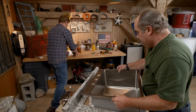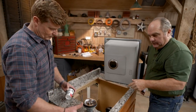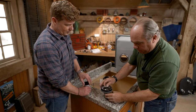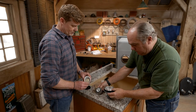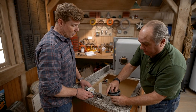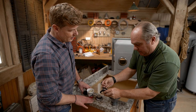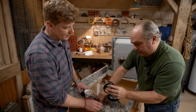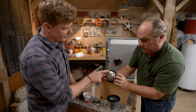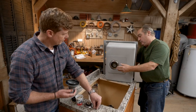Alright, so that's going to fit perfectly. We can do some of this work up here instead of under the sink. Every sink needs a basket strainer, and they keep changing it. We're not going to actually use putty — I've always used putty, but this manufacturer is pretty interesting. They have a pre-made gasket that'll act in lieu of the putty, so we're going to trust it. They call out that this will do fine.